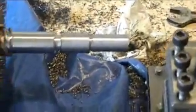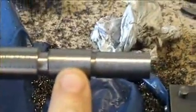This is a video on how to set up a thread cut on a mini lathe. I've prepared a diameter on a screw cut and done a little undercut at the start. It's very important you must do a good size undercut at the rear of it — this gives you enough time to stop the tool without hitting the next diameter.